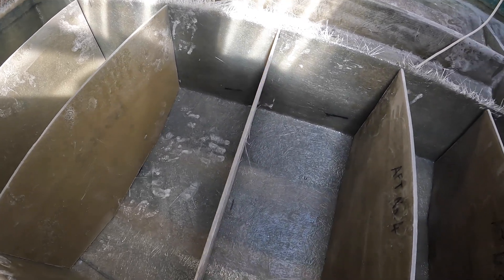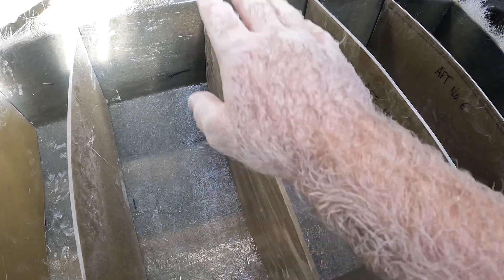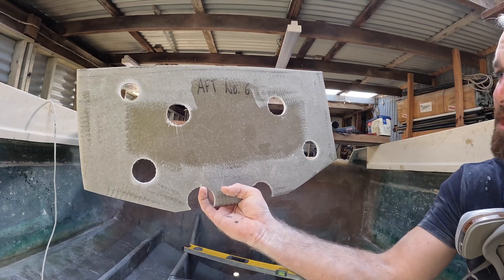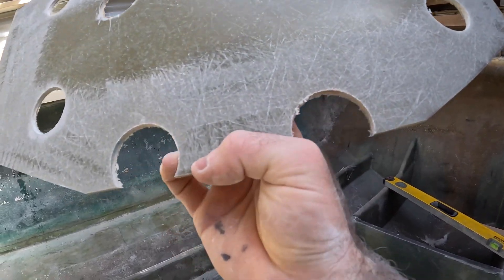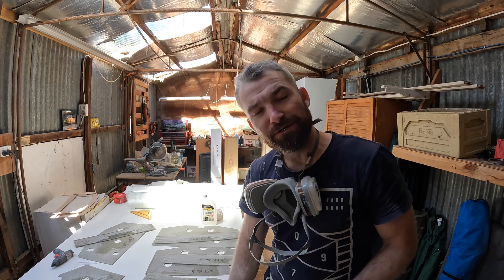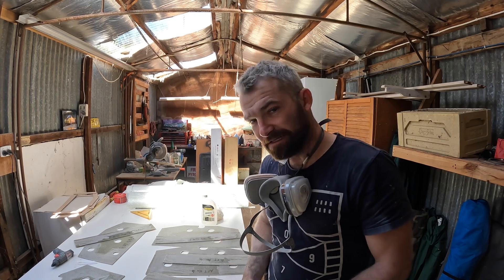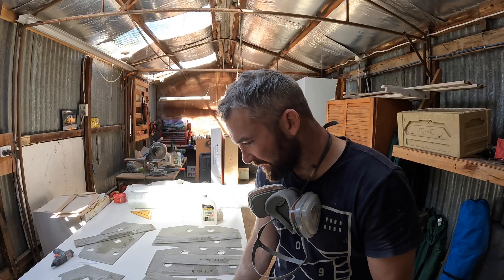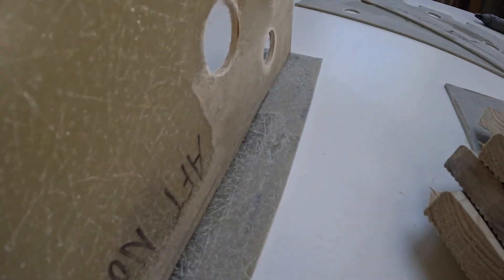Now that profile will be ready to go onto the fiberglass board and we'll cut out our shape, then fine-tune it from there. All we do is transpose the profile onto the glass mat and cut it out — simple as that. With the baffles cut, we're now going to make the 90-degree cap that will run along the top. We've trimmed them, shaped them, roughed them up, and put holes in for the fuel to flow between the compartments. I also did a couple of holes down the bottom so the fuel can drain completely out of each void.